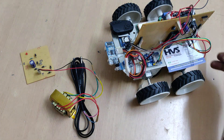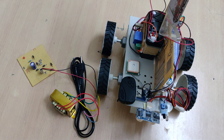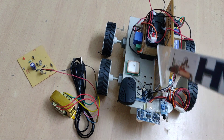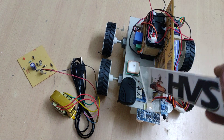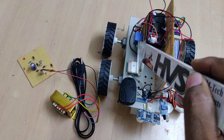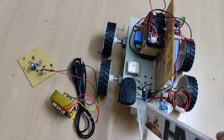The whole system is driven by a 12 volt 1 amp battery. This battery pack consists of three 4 volt 1 amp batteries connected in series to give 12 volts. In order to control the vehicle movement we are going to use this electromagnetic relay, and the controller will trigger the relay to move the vehicle.